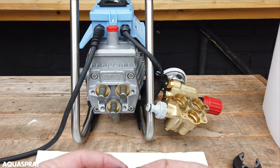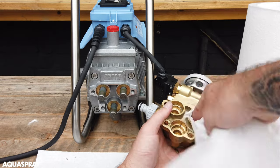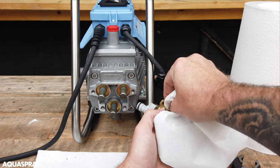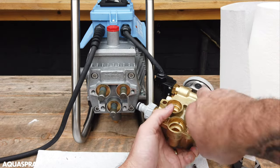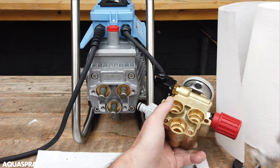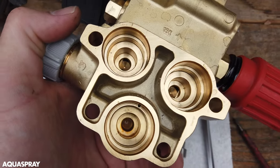This is all just grease. When you replace everything you can re-grease later on, but you've got to make sure that everything is spotless in here — as clean as you can possibly get it. If you have any grit in there it will damage the pump or block a valve. Just take your time and make sure you clean it all. Yours might have debris or parts of seals in there, so clean it until it's as spotless as you can get it, making sure any little bits of debris that could get caught in the valves are removed.